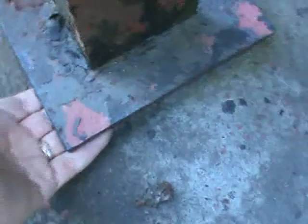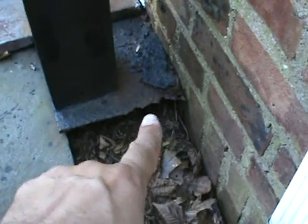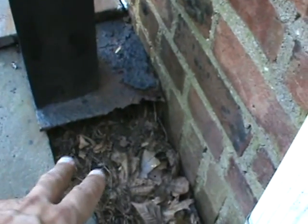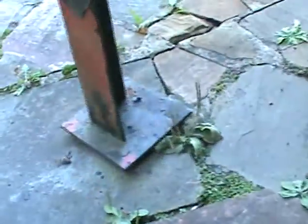on these feet. Because there's been some settling, and this one, if you put your hand underneath here, it's not even sitting, so you need to find out what's going on with the stone, and you need to transfer, because this thing is currently not transferring this load. We need to clean that all out in the back corner. You need to fill that up and make sure it's sitting properly and transferring the load correctly, because right now you can move it with your hand, so it's an unsteady structure. You know what I mean? So look at that one wiggling.